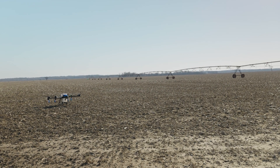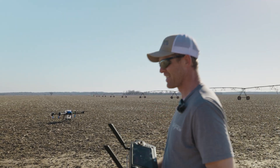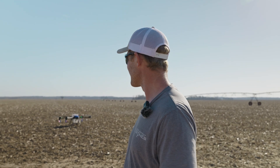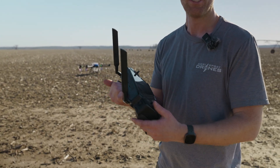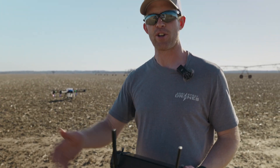But we had very low battery there, so I just let it go. That's like a critical low battery. If you can't get it home in time — returning to home with really low battery — that's what's going to happen: it's going to stop in the middle of the field and start descending. But if you switch it right back up into manual control, then you can fly it manually back home to you.